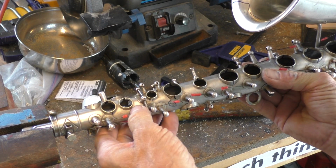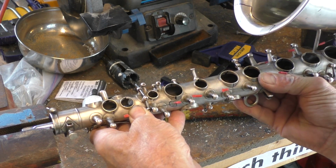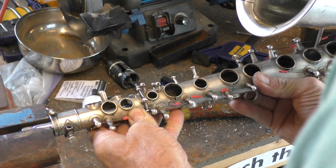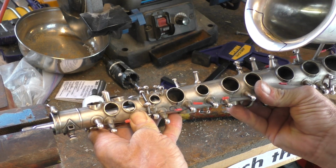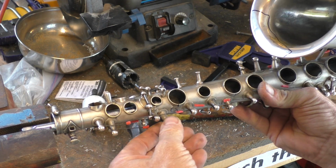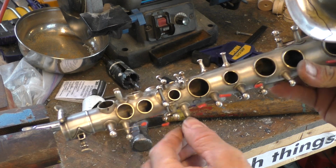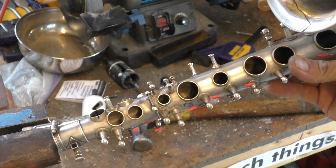Just by hand. Maybe get a finger right here. It's brass, so it should move pretty easily. Just some firm pressure. Let's see what we get. And indeed it did move a little bit. I can see the gap between the posts. Yeah, that did it. That's all it took, was just that little bit. And there's no gap there anymore. And now I can solder it up.